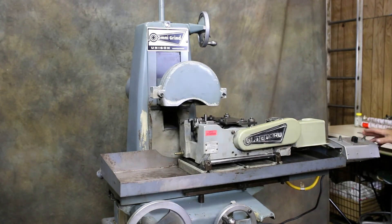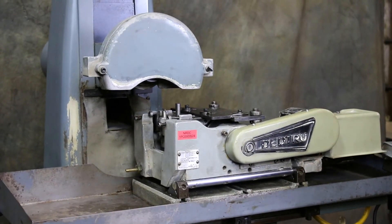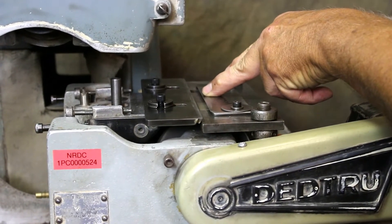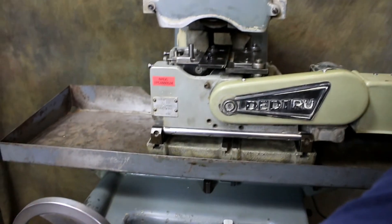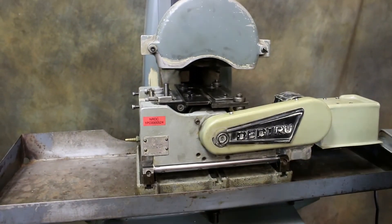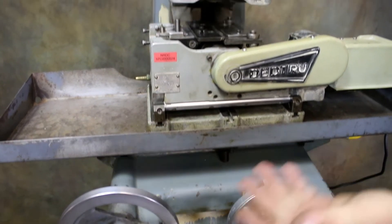We're going to turn this on and the regulating wheel is now turning. We use the grinding wheel from the machine to do the grinding. This regulating wheel can be sped up as well as slowed down — you can see it turning right in between here. You also have manual stops underneath the table so you know right where the center of your wheel is to come in for your grind. Generally you would have your grinding wheel set at the proper height to give you the proper diameter, then slowly come underneath the wheel with the table until you reach your stop, which is mounted on the rail underneath the table.